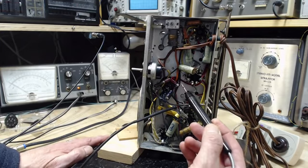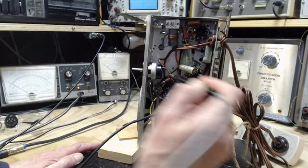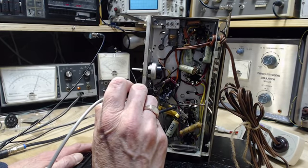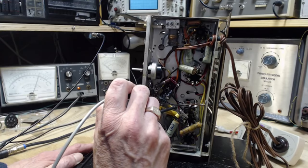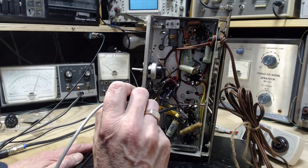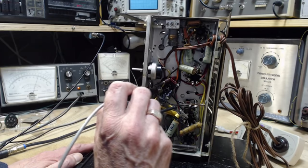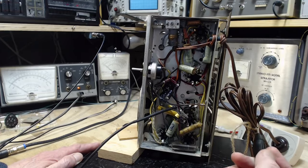We can pick up right here, I'm watching the meter now. So now that's telling me at this point the B plus is all of 77, 78 volts. I'll go on the other capacitor here, much higher, 110, 110 and a half. I think that's what that says. 110, no, 114, 114. Okay, need to practice reading my meter. 114 is okay in a radio like this.